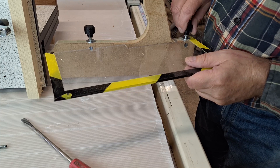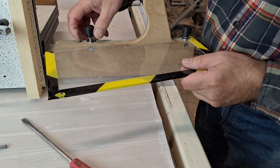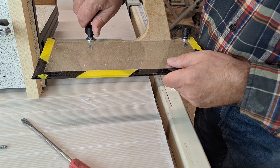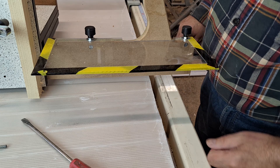The rear guard protects me when the jig is farthest forward at the end of the cut and the blade emerges from the back of the support. I'm using cylinder nuts for a strong, secure fix in the edge grain of the MDF. And just in case you're wondering, the hazard warning tape does more than warn me of the danger of the blade — it also warns me of the danger of the edge of the guard. It doesn't half hurt if you catch your hand on it.